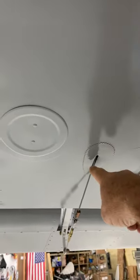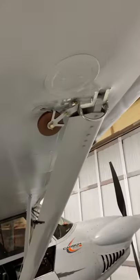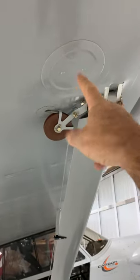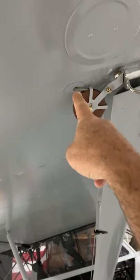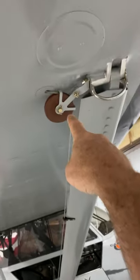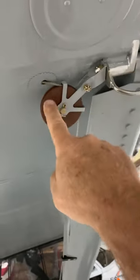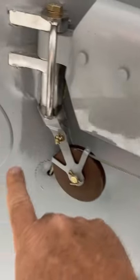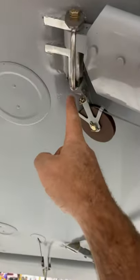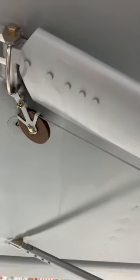That's where you'll grab this cable — the one we've got taped up to all the X bracing in there with the drag tubes. We've got an inspection grommet and cover here for the same thing, just to have access up into the wing. This is your aileron cables coming in. We'll put this on later when we're finishing up the airplane — we'll mount this to the attached fitting here, and it goes right through the hole right here. That teardrop was located in a pretty good position, and that one is pretty much right in line with the strut attached fitting, because that's where the cable comes through, hits this pulley, and goes back in that direction.